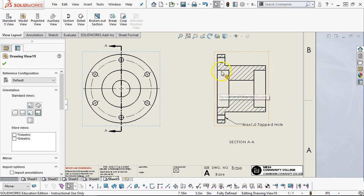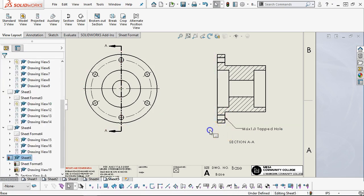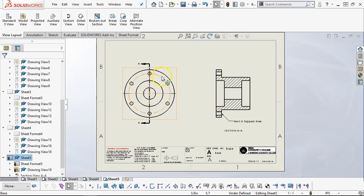All right, so the bearing faces, the outside diameter, if that's going to be the supporting structure, and then the outer flange just has to sit within that spot face to make contact. All right, so I'll go ahead and leave that one there as a reminder, but we'd have some positional tolerance from the axis back over to the threaded holes.